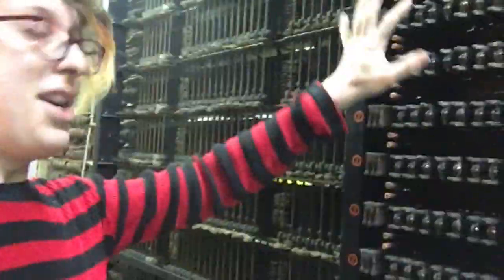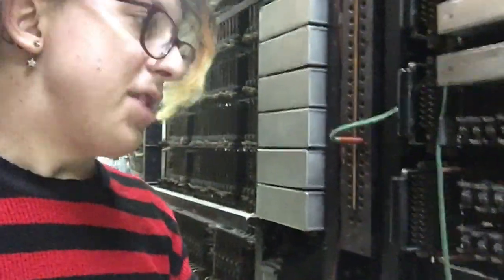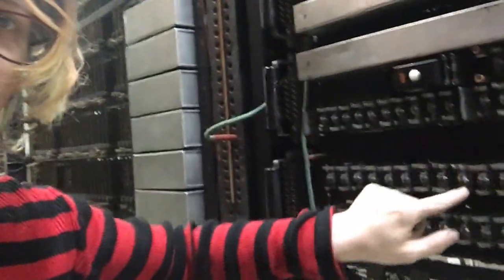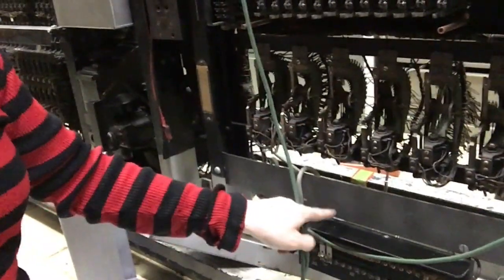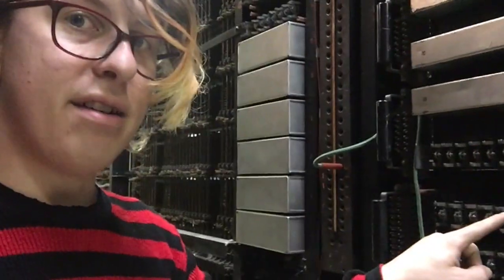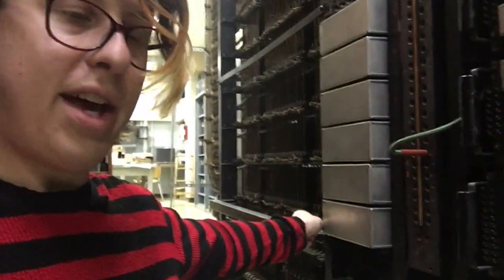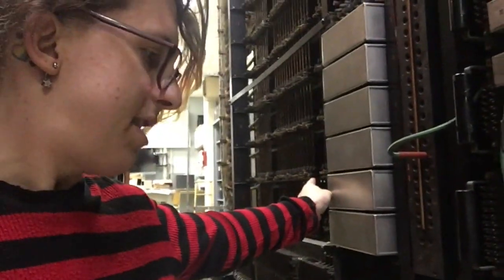So that's still in the works — figuring out why it's getting stuck in position 10. But I think the fact that it was getting stuck in position 10 is what held one of these relays here that is actually on this fuse panel. Short version is: relay stuck, fuse removed over there, this relay stuck caused the line finders to start hunting.